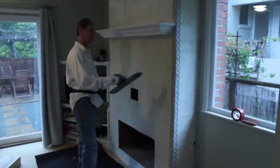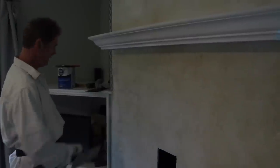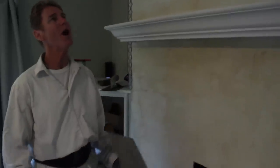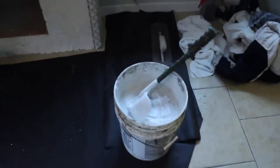What we're prepared to do today — a fellow here gave it his best shot to do this chimney, watching our videos. This chimney is brick, you can see the brick right here. He used plaster of Paris. Anybody know why it's called plaster of Paris? It's called plaster of Paris because it's from Paris, one of the biggest gypsum yards in the world. They make casts with it because it sets so fast — five, ten minutes and it's set. The material we're using has about a half hour.